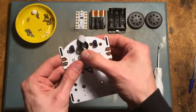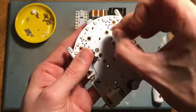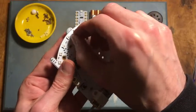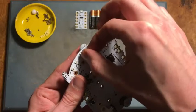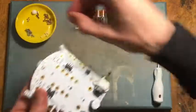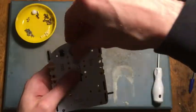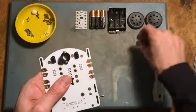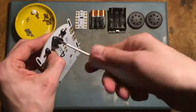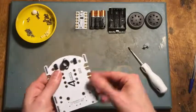So another blob just over the other bolt. Make sure that doesn't move, and then I can just turn that over. I'm going to take these nuts and just get them started on these threaded bolts. This can be a bit fiddly, so take your time. Once they're on there, there's no need to tighten them up — we'll tighten them from the back. Take the blue tack off, and then just with a screwdriver, hold the two nuts in place with your fingers and tighten those up a bit. They don't need to be super tight, they just need to not rattle. Once that's on there, you can just pop that ball back in.